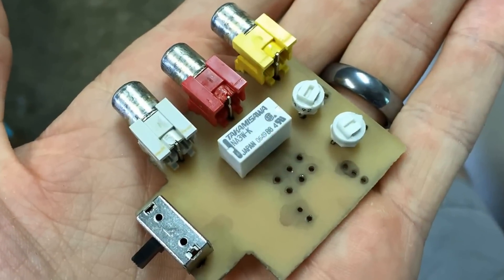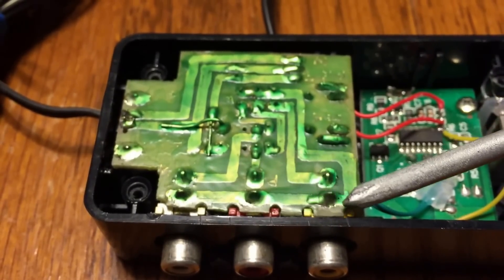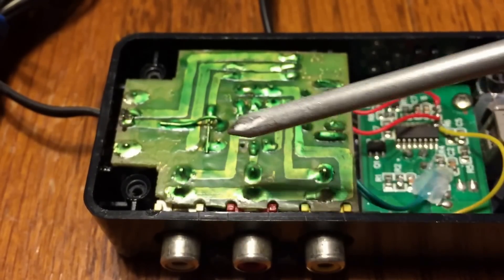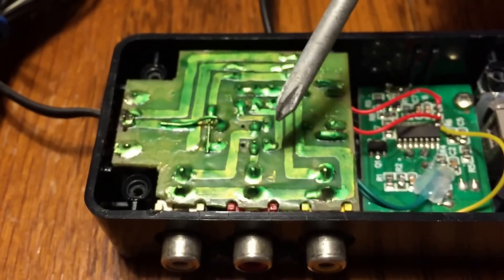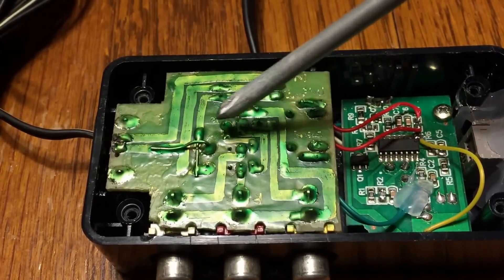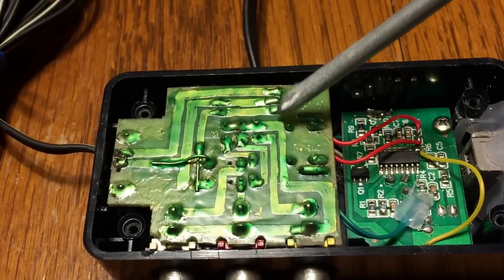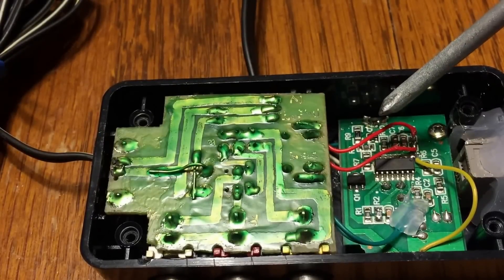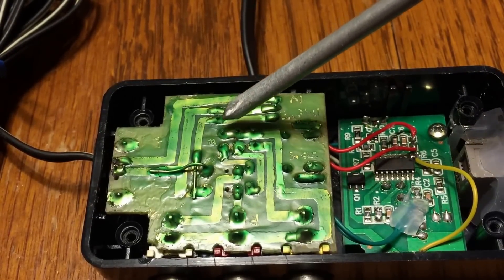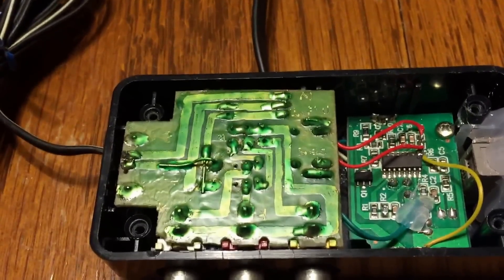This is the bottom side of a relay — it's a 3-volt relay, dual pole, dual throw. Basically I've got this strip here as the common for both the white, red, and yellow plugs. The signal off of the white comes down to a relay pin — when the relay is powered on, it will send the signal over, which goes out through this cord to the TV. Same way with the red. These three connections are for the cable that goes to the TV; these three wires come over and connect to the board with an input, an output, and a source voltage. I've got an LED soldered in here that runs over to a switch so you can turn it on and off.